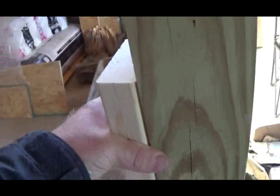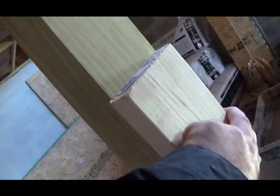This one gets turned into one like here and one right here for this little partition wall for the concrete bar counter that will be over there for the wood cook stove. And then this will be a little partition wall where the other stove will be, the propane stove. That'll be the same thing. So for simplification, 4x8, 4x8, 6x6, 4x8 is more or less what they'll turn into. At that point, they're plenty strong for being a green roof, I would think.